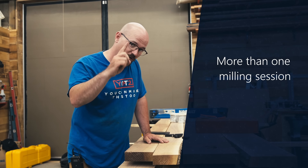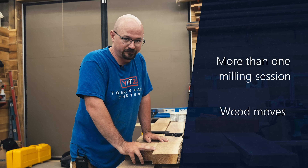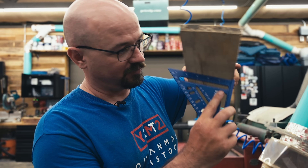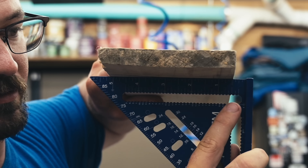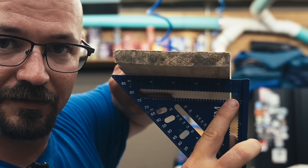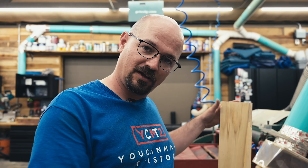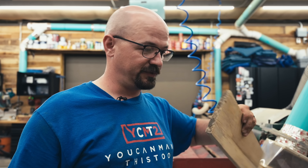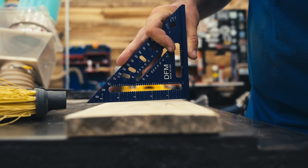More than one milling session: wood moves. Here's a piece of what was four-quarter poplar that I milled — I want to say twice — but it sat around for a while. Obviously it's been milled, but check that out: it's pretty cupped. It's just been setting against a wall with airflow around it, but this was fairly cupped before I first milled it. That's why you give yourself room and time.